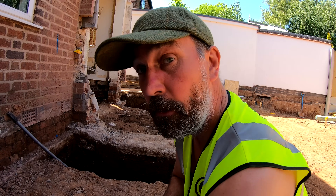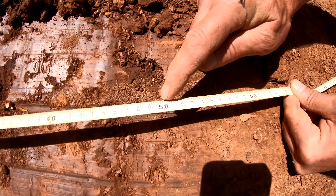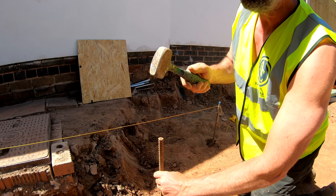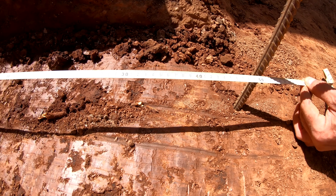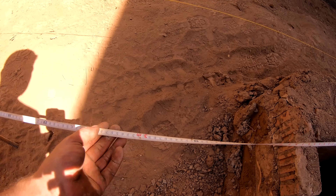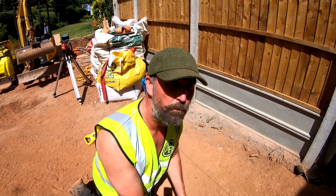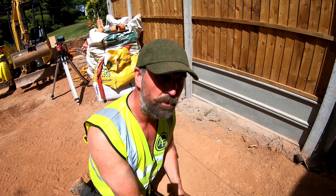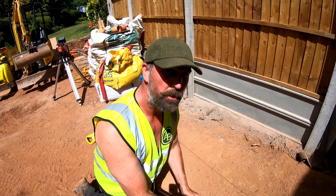So me and Pete are going to go three metres 500 from that building all the way this way. So that's the measurement there — I'm going to put my pin at that point like that, and that's going to be a temporary pin. I'm just going to check that's three, five — that's it, good. Now 3.5 is basically about here. I'm within five, ten mil and I'm not overly fussed because at the moment I'm just giving myself a guide so I can set up where the footing's going to come. I've got to make sure the building's square to where I've put this footing through. So I'm just going to drive this peg home at three metres 500.